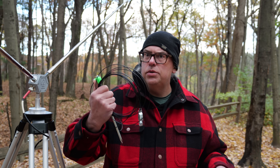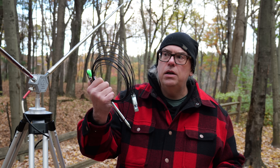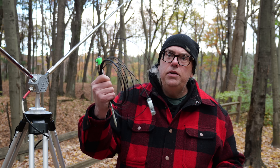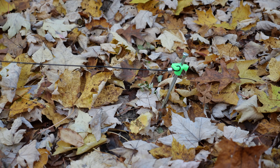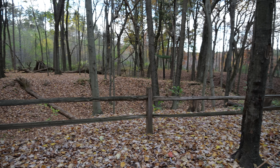If you want to use the Hextenna on the 30 and 40 meter bands, you take these included wire elements — extenders to extend the whips out for 30 and 40 meters. For the 30 meter band, you retract the whip to about 4 feet and some inches, then attach an approximately 18-foot extension. For the 40 meter band, you extend the whip to about 15 and a half feet and add the extension. The extensions just clip right to the end of the whip on the little ball, and stake down to the ground. Going to try tuning this up for the 30 meter band, and then 40 meters.